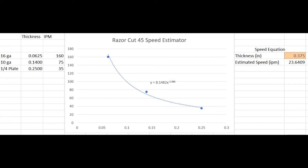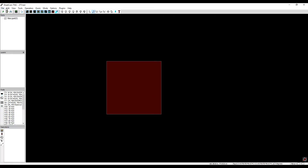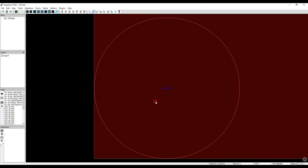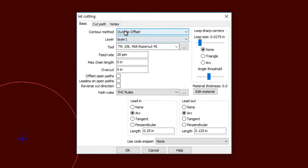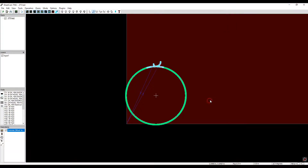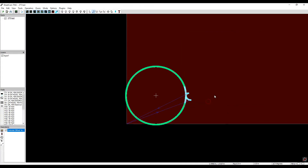As we'll see later, 20 may not have worked out all that great. Here we're going to make a really quick circle — I want it to be 2 inches or so, because the customer wanted a gusset with holes around 1 and 7/8, so I figured might as well do 2 inches. Make sure you import it into SheetCAM using New Part. Then go up to Operation and select Plasma. We're going to run it at 20 inches a minute. I'm going to set the delay at 0.7 seconds and the pierce height at 0.2. Let's go ahead and post-process that and get it out to the CNC.